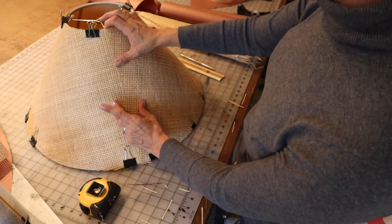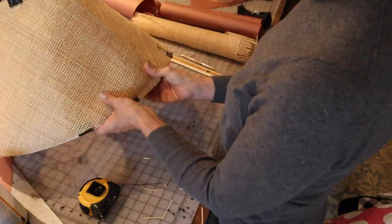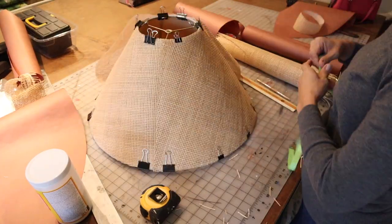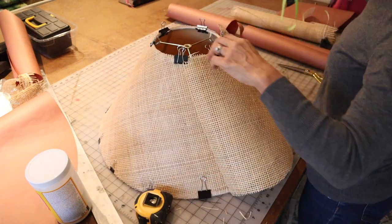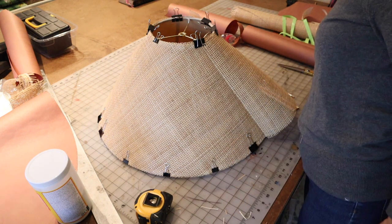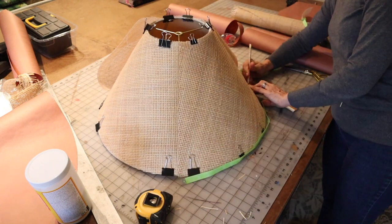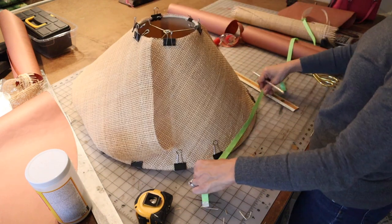Now that's just a tiny little overlap. What I'm going to do is measure this and mark it so that it's evenly in three sections. That's 68 inches around the bottom, so divided by three, about 22 inches a piece. I'm going to start from this seam here and go 22 inches both ways. 22 takes me to there, and 22 this way.